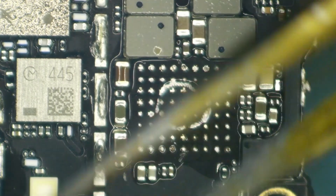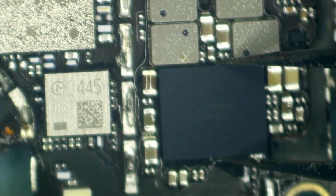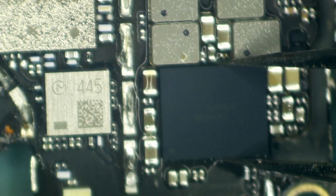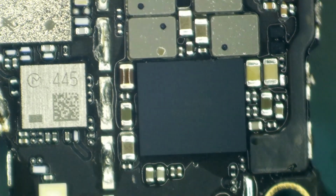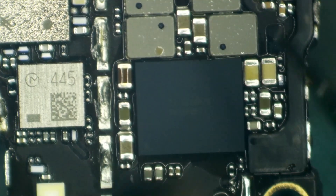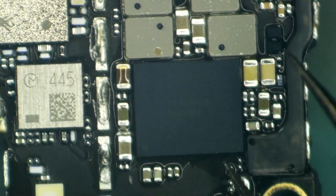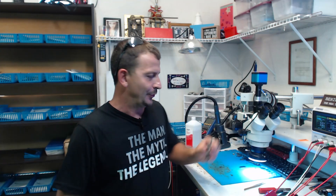Every time I go to record a video I blow the chip all the way off the bench! We're going to warm this up until the flux starts to bubble, then let it go and it'll stick really good. That's one reason I really like my Chip Quick flux — this is Chip Quick SMD291 flux. All the tools I use are linked in the description below. Let's warm this right up and let the chip fall down into place, then give it just a little nudge. Okay, that chip is on there — we have a new chip on this board.